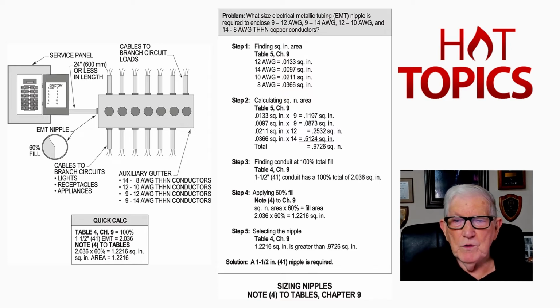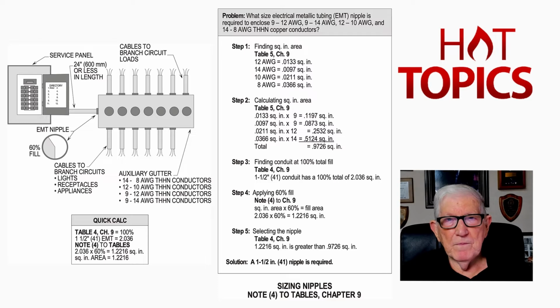So in step 5, you have to compare. Will 1.2216 be greater than 0.9726, which we looked at in step 2 in our total? It is, so we could use a 1.5 inch nipple there. So what is the difference now between a nipple and a raceway? A nipple is 24 inches in length or less, and anything over 24 inches is a raceway, and we're going to review that in our next video here. So watch.